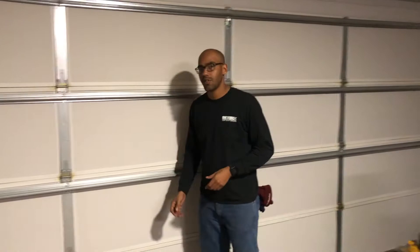There's only a couple ways that that can happen. If you notice over here, if you see the green solid light on your sensor over here, if I obstruct this beam, the light is going to go away. That is always going to need to have a constant contact to keep your door from stopping and reversing on itself.